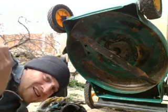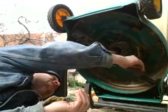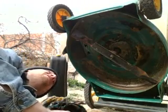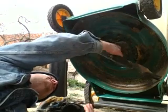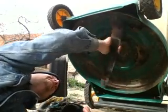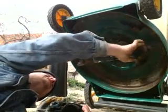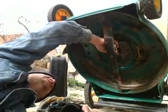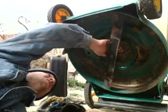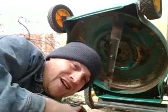Looking at this blade — we want to make certain that this is nice and sharp. Looking at this blade, we've got some dings from rocks and other things that ran over it. The shaft looks pretty straight; it's not bent, other than squeaky — as you can hear that squeak. There's some black oil in there. We want to keep this thing from turning; there are a couple of ways of doing that. You can get something on the shaft right here on the top side to keep that from turning. I'll get back to you in a second, YouTube, so stay tuned.